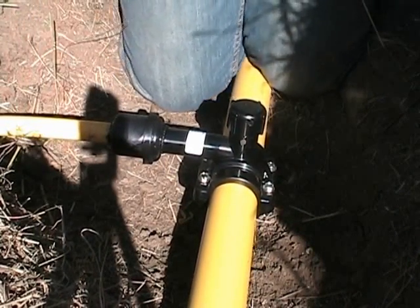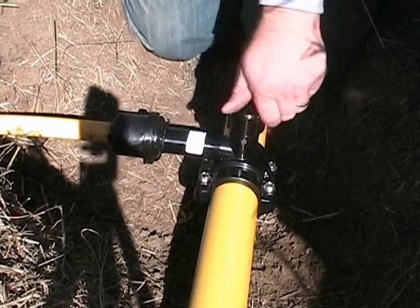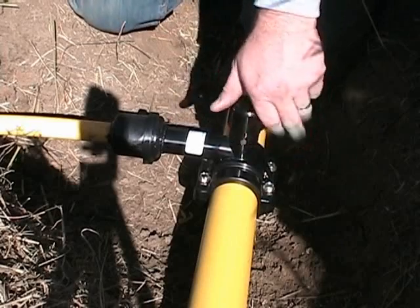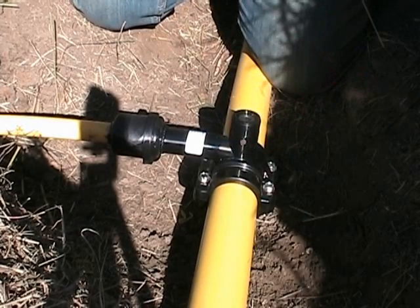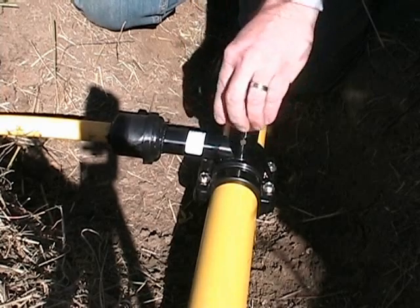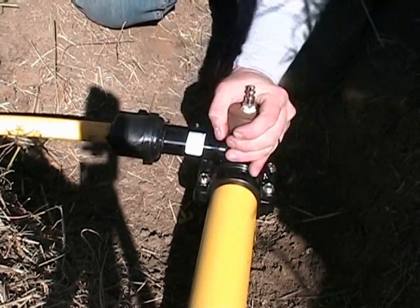To assure proper assembly and to comply with Title 49, Code of Federal Regulation 192, Subpart J, test requirements, the joint shall be leak tested. Pressure testing can be done through Continental's test cap or pressure test through the service.